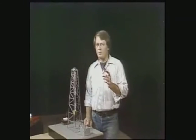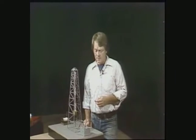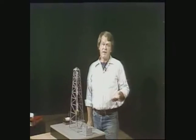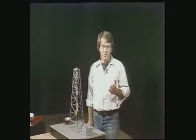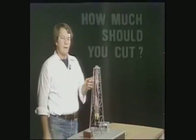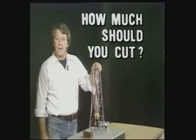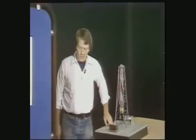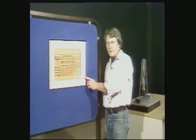That's the key to extending the life of your drilling line. It's important when slipping that you don't move any critical points on the line to new points of stress. You've got a complete set of critical points at each pickup point, so you can't just slip some random length. You have to find a length that moves every critically stressed point of the line to a point of non-critical stress at both pickup points. The right slip or cutoff length for your rig depends largely on the mast or derrick height, because it affects the distance between the critical wear areas on the line. A simple way to figure the cutoff length for your rig is to use this table published by the American Petroleum Institute.